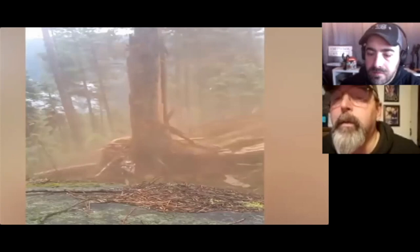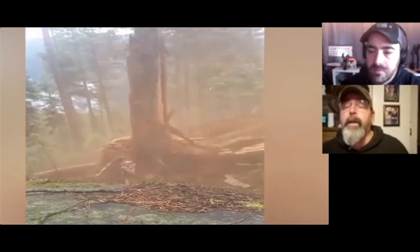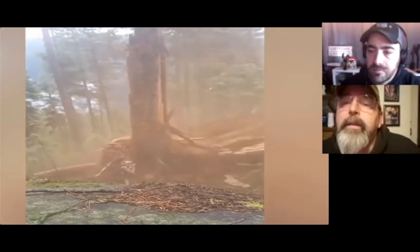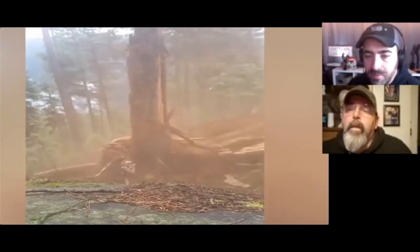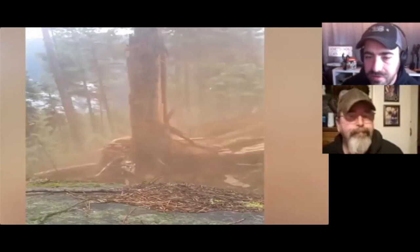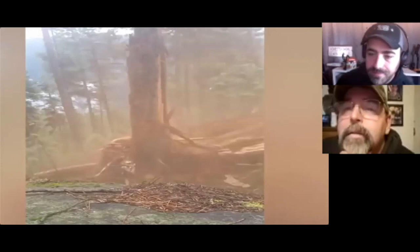When you come into some really crappy wood, it blows out like red dust. So right there, you need to reassess. And if he was running into that red dust when he was notching it, then this all could have been avoided. I haven't run into this too much, but I have hit rot a couple times in a tree, and I was usually able to notice pretty quickly that the saw isn't requiring as much power anymore. The sound of the saw changes as it's going through that rot. It's going through something really hard, and then it's just like it's going through the air, basically.